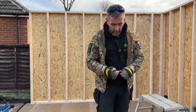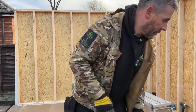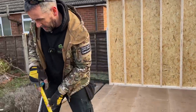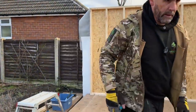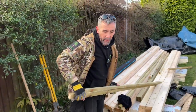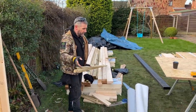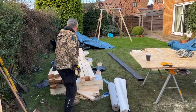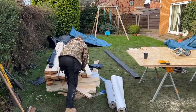I've centralized it, made it look parallel — it'll look nice visually from inside and outside, perfectly parallel when you're sat in the room. That's the window, that's the TV on the wall in between the two windows, and that's the other window, with a nice little corner nib. I'm going to cut two lengths of 4x2 for my base plate and head plate — I'll fast forward the cutting and then sit down, mark it up, and show you how we transfer the marks from the floor to the timber to build our stud wall.